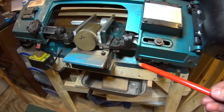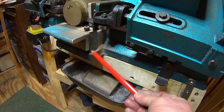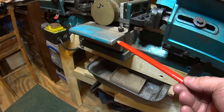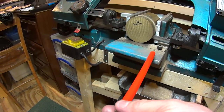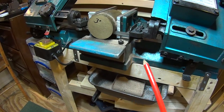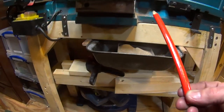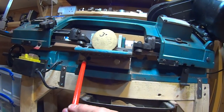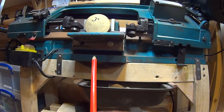The other modification is this extended plate. That was a bit tricky because the angle of the casting means you can't just use a 90-degree piece. It's 2 pieces of 10mm thick steel off-cut. I clamped a piece of steel in the vise, clamped this up to that, then used the grinder to put a slight angle on the second piece so it sits up properly. I drilled 6.8mm holes through the casting and tapped them to M8, then bolted it on.